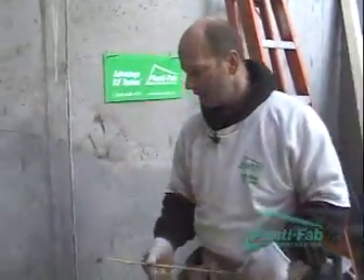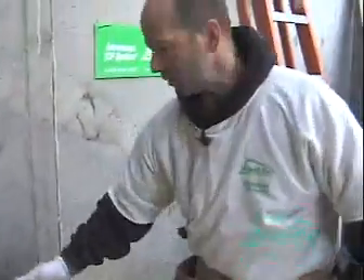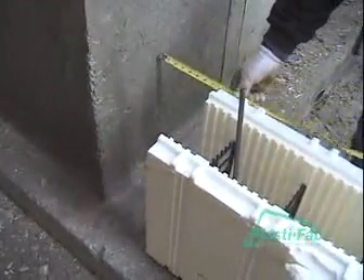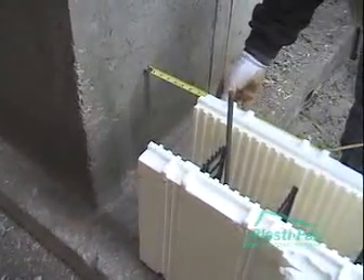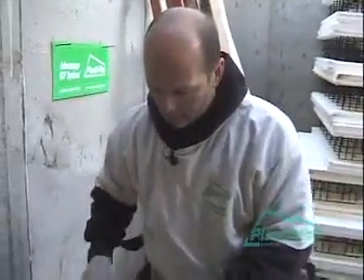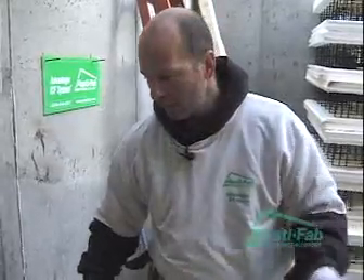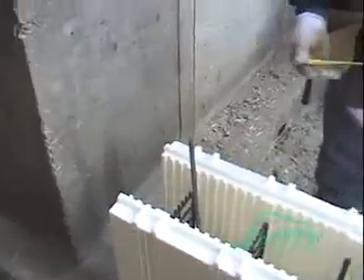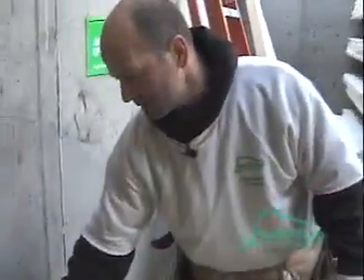By determining the optimum length, our blocks are laid out except for this first little portion, or last portion of wall, and it's approximately 8 inches. This works out really well because the increments of our ties on our block are 8 inches on center. So we'll be cutting a block that is roughly 8½ inches long to fill that gap, and it can be anywhere in the wall, but we're going to place it right at the end and work back the other direction.